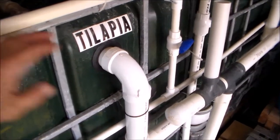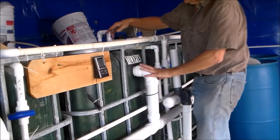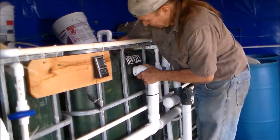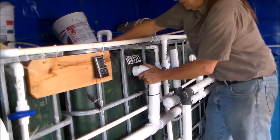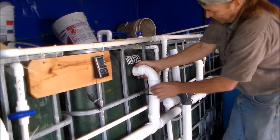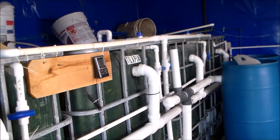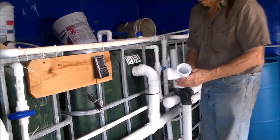I'm going to open up the valve full force and see if it handles the full volume of water coming in. Let me change this out right here — I just turned the water off, so there's still a little bit draining. Most of these pipes I did not glue together for the reason that I saw I may need to change things. This one here is glued, so I need to cut it to get that T in. Here's the T that I'll use.